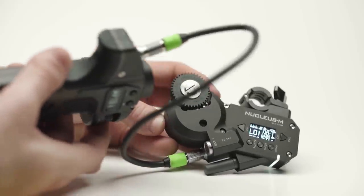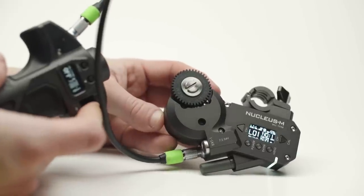Another trick: you can connect the EXT port on either of the controllers directly to the motors, which bypasses the wireless system altogether. So if you're having interference problems on set, this could save the shot. Also, the torque of the motors can be a little high even on its lowest setting, but the lower the voltage the motors receive, the lower the torque they'll deliver. So if you're worried about auto calibration damaging your lenses, you can power the motors directly from the controllers via the EXT cable, bypass the DTAP cable, calibrate with 7.4 volts instead of 14, and then plug the DTAP cable back in and remove the EXT cable.